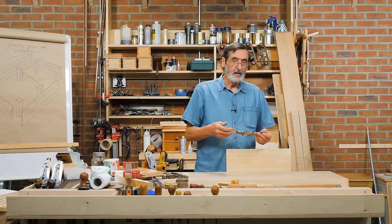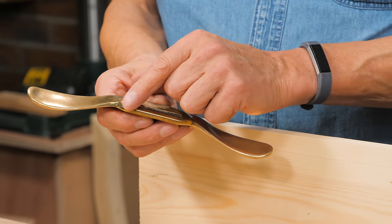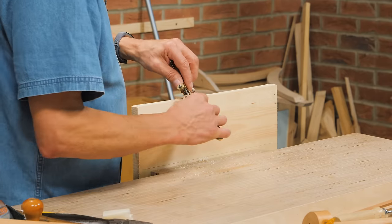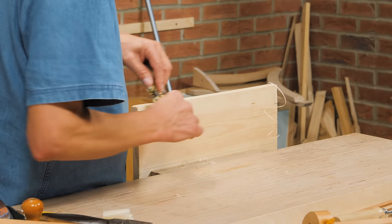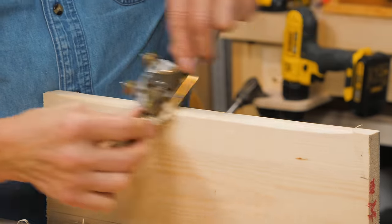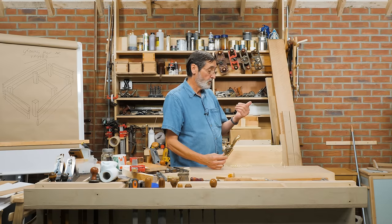If you've got a Stanley, a Record, or any other make of spokeshave and you want to set it, what I found really helpful is to set one side really flush and this side as heavy as I want. That way I don't have to readjust the spokeshave when doing a round over. Place it on the wood — here I've got the coarse side and here I've got the fine side. I go to the coarse side to get my heavy cuts, then move to the fine side to take my refining cuts. I can move anywhere in between to get a thicker or thinner shaving according to what I want to take off.